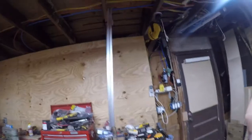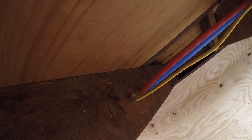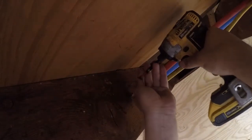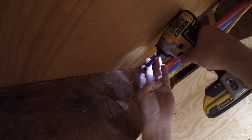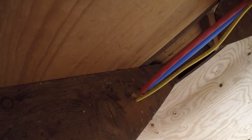This is where the way these are installed, this mounting mechanism, is an advantage, because on the Commercial Electric lights that came from Home Depot, I didn't have that option. They're just in little slots, and they tend to come out of the slots if you disturb the lights much. So I really like these, and eventually they'll be all that's in the shop. I want you to see that this is really not a very complicated process. You just pick a spot and install a screw, and you want to point the screw slightly down. That's really all there is to it.